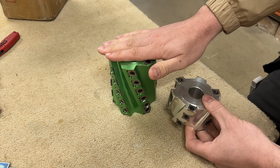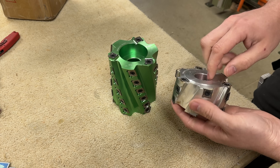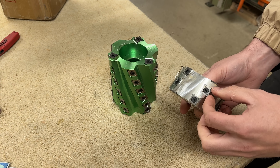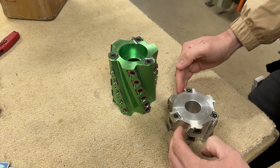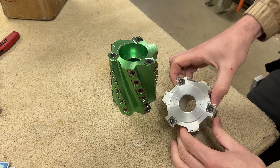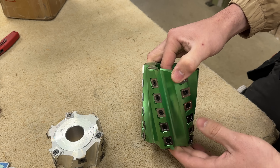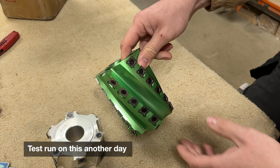This was the inspiration for making this cutter block. I use this rebate block all the while — it's nice and light, easy to put in the spindle being small and made of alloy, dead easy to pick up and handle. It's always sharp; these carbide insert spur cutters seem to last forever. Being only 100mm diameter, you can get your fences really nice and close to the cutter, which reduces the snipe at the start and end of the cut. I just wanted a bigger one — a taller cut for bigger rebates. I can do a bit of planing as well, and recess those deep angle cuts using the recessed top. So hopefully this will be a good investment.